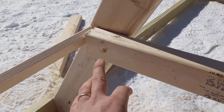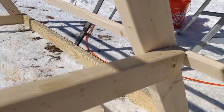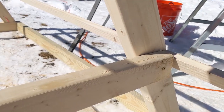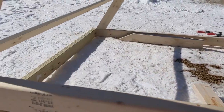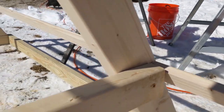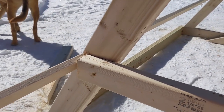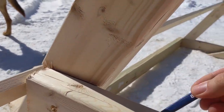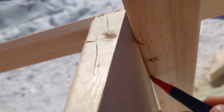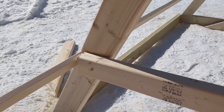Okay, so what I've done here, and this is a simple way to get an angle, because I know that there's a mathematical way to do this, but if you've watched our channel at all, you know I suck at math. So I have my reference line here, and I have my reference line here. So I just lined this up and screwed it in. And so what I'll do, I'll take my pen and scribe a mark on the back side of each piece. Then I can make a cut and it should match up perfectly.